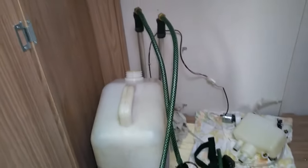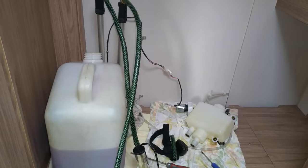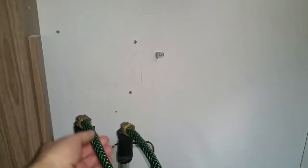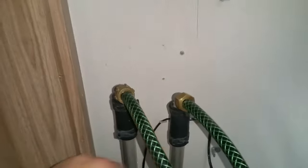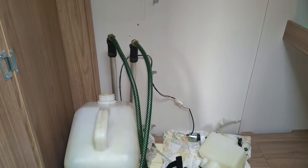It's clearly quite important to have the inlet and outlet barrels in the caravan near the connections just below them. Because when it's full and you want to disconnect, you're going to want to drain the hoses back to waste, and drain the remaining new chemical back into the drum so you can top up with it. That's why everything's inside. I originally thought I'd do it through the window, but I realised that would leave a lot of hose to drain and I'd lose some of the new chemical.